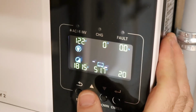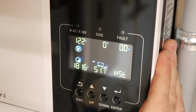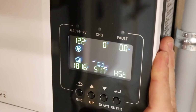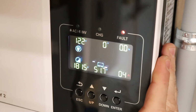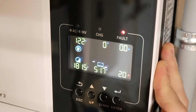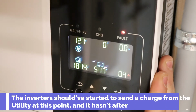So, and they're flashing red. When they flash red, from my understanding with those EG4s, they're basically very low. So they're below 25%. They're probably around 15%, 10%. They need to charge. I've had these running for about 10 minutes. So the inverters have plenty of time to cycle through and actually start their charge. I'm getting that error message. I don't like that. Doesn't give me any confidence.